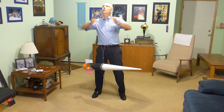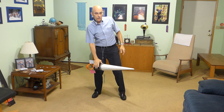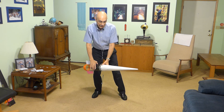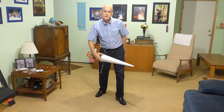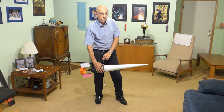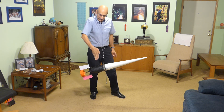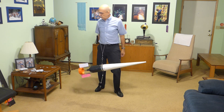Now, about the rig — you need two strings. They should be two to three feet apart, about a meter apart. If you don't, your rocket will be free to move laterally and that will not give you accurate results. If you have one string, as the pressure moves it this way, it's going to stop moving and relieve pressure by sliding. With one string you will get erroneous, ambiguous, wrong results — you must have two. Down here you want about three inches of thin, single-strand string that's free to turn. You do not have to use the weight, but it gives you a more emphatic result.